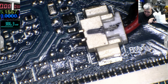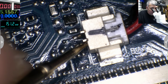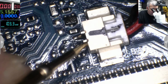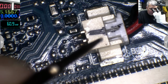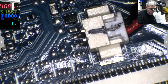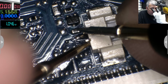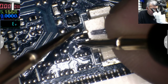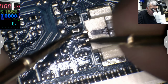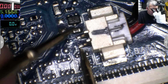Volts. The multimeter on screen. Plus. And we have 0 volts on the battery connector. Yeah, we have 0 volts. So our battery is dead. Let's switch on the diode mode. Plus with ground is not short. But the plus, let's see if it's going here. It's not going here. The ground here, it is ground. Okay, so here is a short on this power rail.